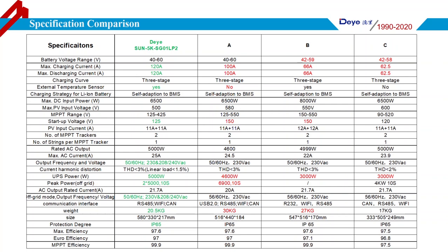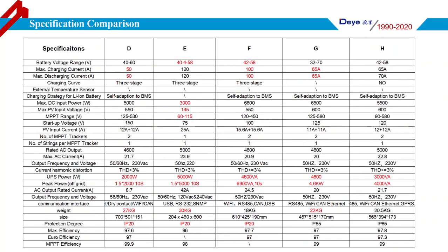The next entry is the start-up voltage of 125V, which means the Deye Hybrid Inverter can start up at 125V of DC input voltage. Others are 150V. Thirdly, the Deye Hybrid Inverter supports 208V and 240V, suited to the American grid standard. Also, a new item is product weight — the Deye 5kW Hybrid Inverter weighs only 20.5kg, which means one person can carry it easily.